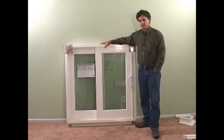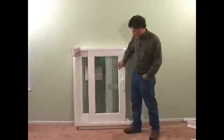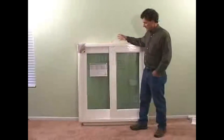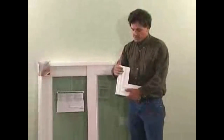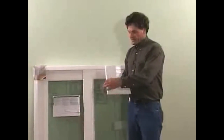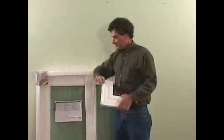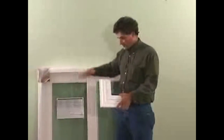This is the 980 French-style sliding door. It's a slider designed to imitate or simulate a French door with a wide frame around the glass. This particular one is a block frame with no fins. It's available in new construction with a nail fin, or in retrofit versions with the brick molding fin, the standard single wall thin fin, or the dual wall fin. If you're putting this on stucco, the brick mold is the way to go — it's designed to simulate door molding and blends naturally on the outside.